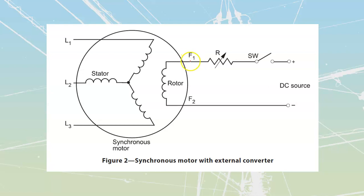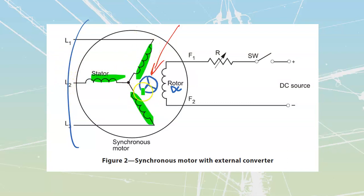The schematic shown is an incomplete drawing. It shows the stator as a standard three-phase connection and the rotor DC field winding, but it doesn't show the amortisseur winding — which can be represented as a Y with its leads short-circuited. That AC winding is what gets us up to speed. When we turn the motor on, the rotating field cuts across the amortisseur winding, starting rotation. Once rotation is pretty much up to speed, we kick in the DC, which locks us into synchronous step. The missing component on all schematics is that amortisseur winding.